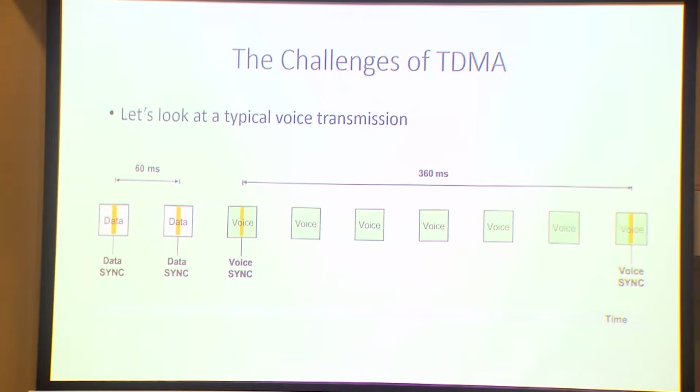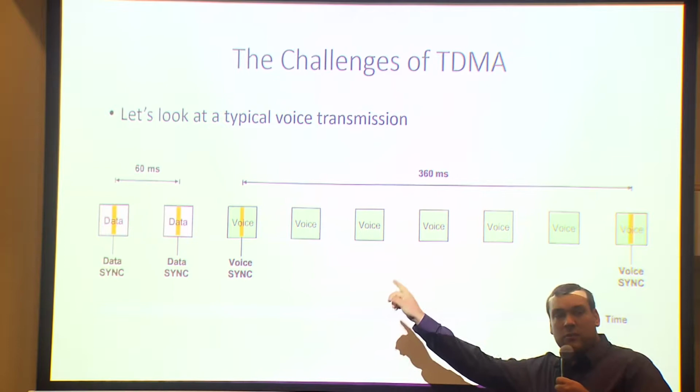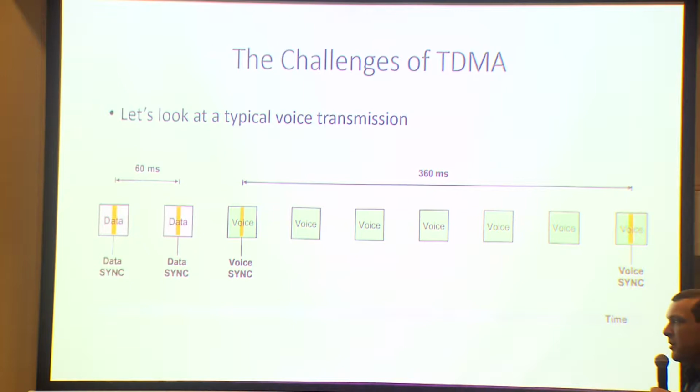So this is a typical transmission. The first two packets, the first one could be a wake up: Hello, I'm ID 505-2045. I want to contact this talk group. Please wake up. The repeater comes back: Yes, go, you can start transmit. Then you get into the voice. You see the first three packets there have sync data. We don't have sync here, or here, or here, or here, or here. We have sync here. This is why the receiver in the software has to keep track of what the transmitter's doing, because there's no sync coming back for these five packets, and why timing is so important.